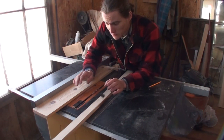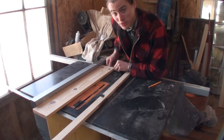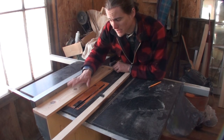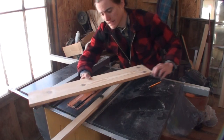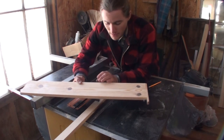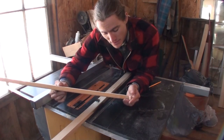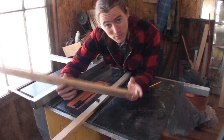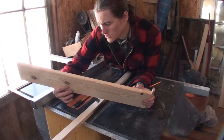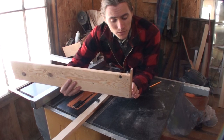I'm going to clarify a little about how the tapering jig works for tapering the legs on this sofa table. If you'd like to see a longer video on how to make a simple jig like this or a more elaborate version, let me know in the comments. This is just a pine board — it would be best to use a more stable piece of plywood, because as you can see there's some wobble, which is going to cause burning on your leg and potential danger. I only needed to use this once, making it specifically for these legs to get a quick solution.